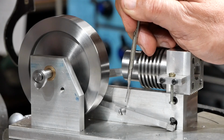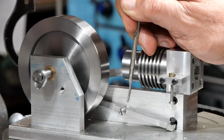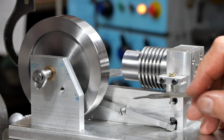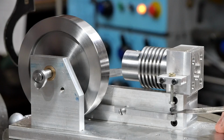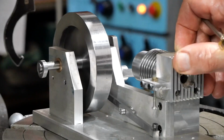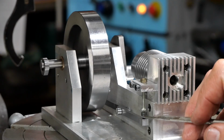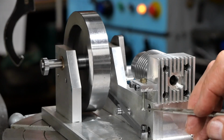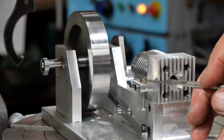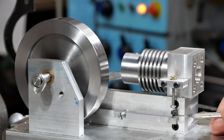And the reason I did all that was so that the unthreaded shank, the plain shank, would butt firmly against the side frame. That's the whole point of a shoulder bolt. So you can do the bolt up firmly, but it won't trap the pieces that are under the head. So I made up a spacer, of course, to go in there, and after a bit of experimentation I've got it so that this screw, representing the tappet, will come up underneath this screw, which is representing the top of the tip of the valve stem. This is just a bit of scrap to put that positioning piece there. Anyway, so now I'm satisfied that I've got the rocker arm in the correct place.